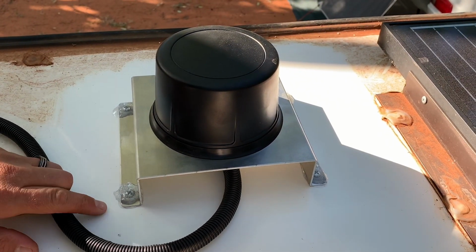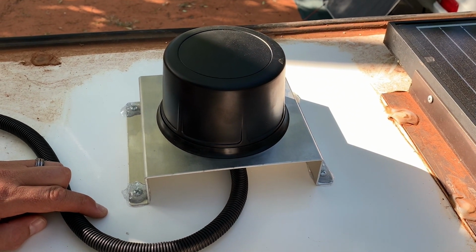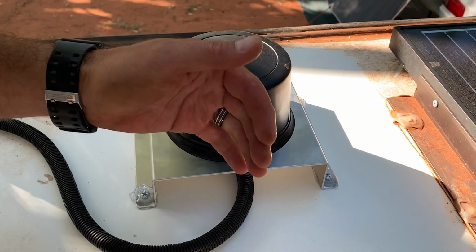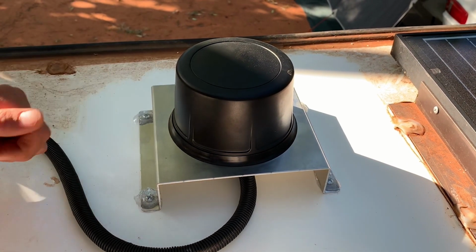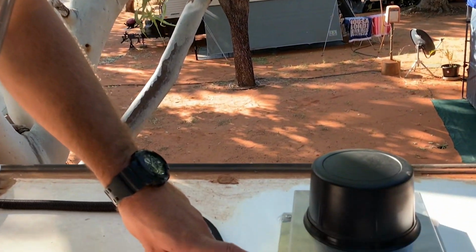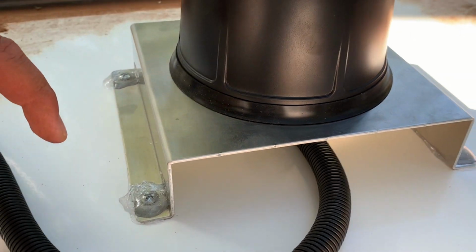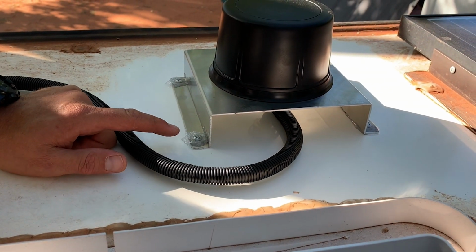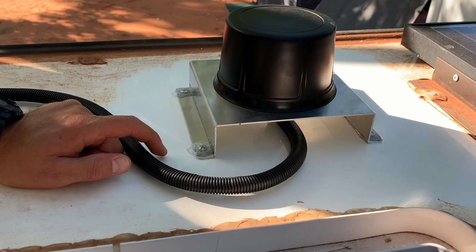Yeah, so it's basically 4 screws. It's all you need. Obviously be careful drilling into your roof as there's cabling running through that. So I've checked obviously lighting inside, making sure there's no cable routes underneath where I'm screwing or where I'm fixing to the rooftop. And then I pre-drilled my holes essentially with the screws, pulled it back off, siliconed it, and then remounted the bracket. Also making sure to silicone above your screw because you don't want water getting in and around that.